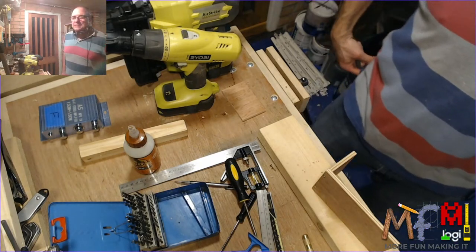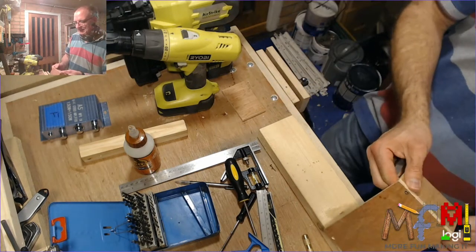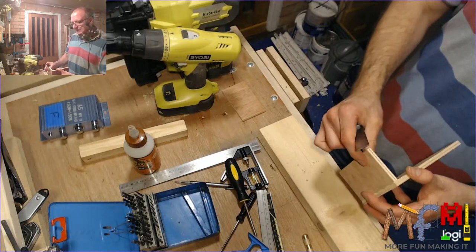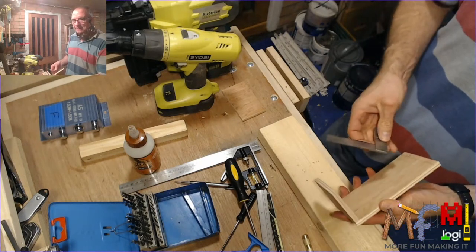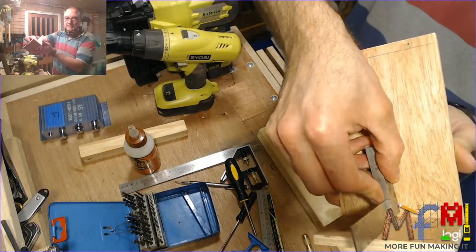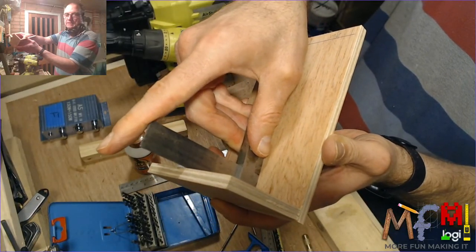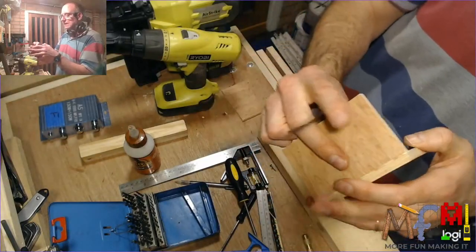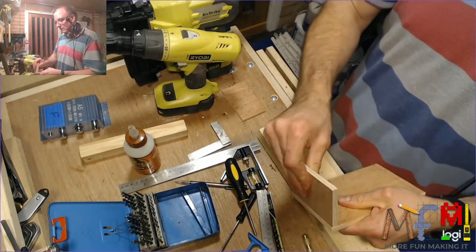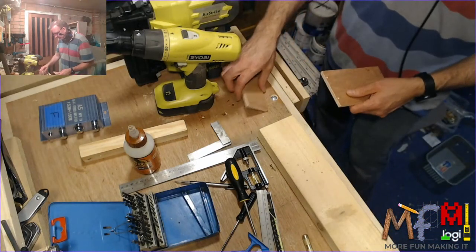This little test can be spoilt by impurities getting caught in the edge. But how square are we? Because if these edges are square and this is screwed to this, then that should be square. Oh, it's really close. You see that? Oh, where's the camera? There it is. So there is a small gap at this end. I can just rock it a little bit, but like I say, that's going to be impurities, especially where I was drilling through, there's going to be stuff floating around in there. But it's solid as well. I wouldn't sit on it. I definitely wouldn't sit on it. Chunky monkey.